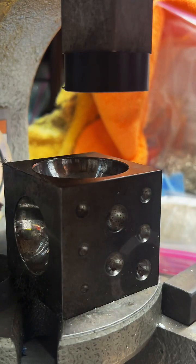I usually use a half-inch punch unless the customer asks very nicely for something else, or it's like a really small coin, like dimes, I use 3/8, but from quarters all the way up to 1 ounce rounds, I usually use a 1/2 inch punch. That's what I'm really comfortable with. I found that allows for a wider range of sizes.